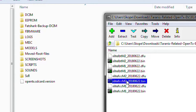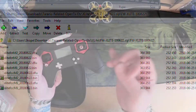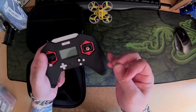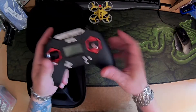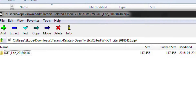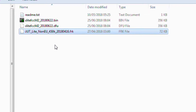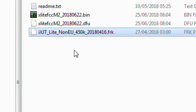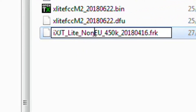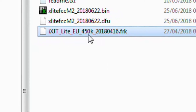I'm using mode 2 FCC and I need the non-EU XJT flash, but that's where the problem lies. I don't know why, but if it detects it's a EU base unit, it won't show the non-EU XJT firmware. An easy workaround is to just rename it to the EU firmware name. I'll take you through flashing this quickly.